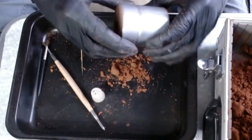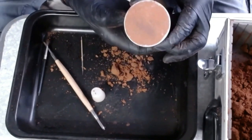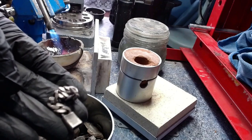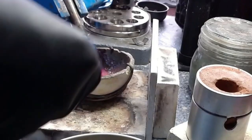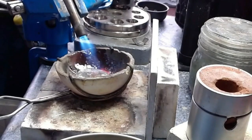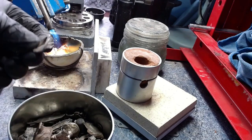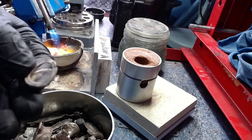Making sure I don't brush off all that talcum powder, otherwise the two halves will stick together. You can see that's about an eight or nine millimetre pouring hole at the side. So instead of having a small hole to pour in, I've now got a much bigger hole to pour in, and only a tiny area of eight millimetres. Now I'll put all the bits of scrap silver in that I found whilst I was detecting.